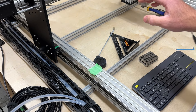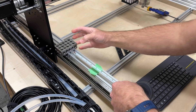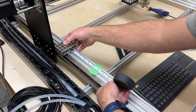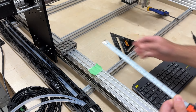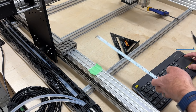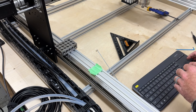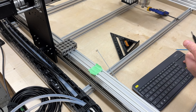The machine moves back. I take my setup block, put it back in the same location, make sure it's square, and measure. I had the same steps-per-millimeter setting for both X and Y, which were incorrect — I'm moving 125 millimeters again. In the software I put in that the actual travel was 125, hit 'set travel' and 'next,' and it tells me it needs to update my steps per millimeter again. I confirm, and it updates. I then restart the tool.